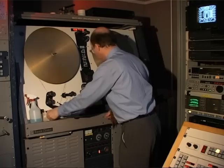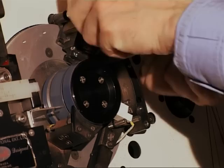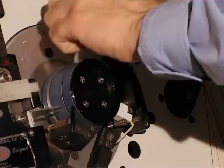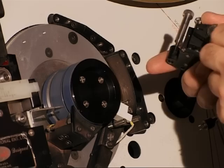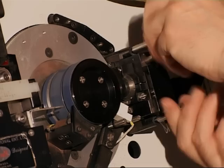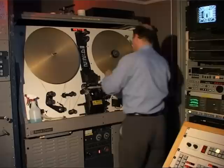While we are here, we can also clean the optical sound heads. These simply unplug and unscrew. This is the 16mm one; just put it to the side. And a 35mm one. We need to check that the photocells which run in the grooves on the capstan are clean — so gently with a cotton bud to remove any film dust and debris from the surfaces. Then likewise the lamp units — check that there's no debris in the windows. They simply screw back into position and locate positively, so there's no need for any alignment or adjustment.